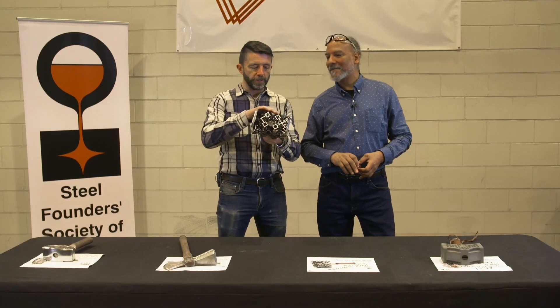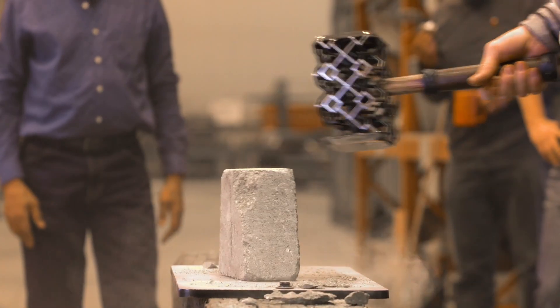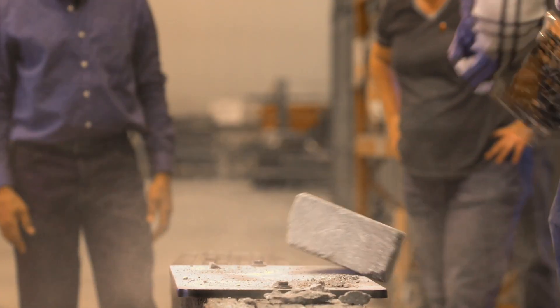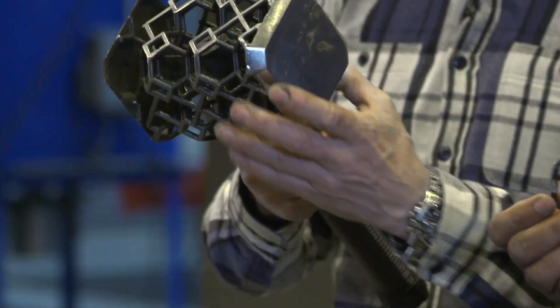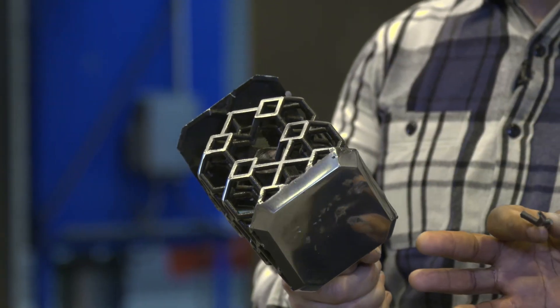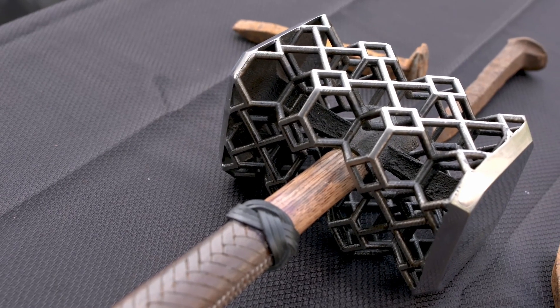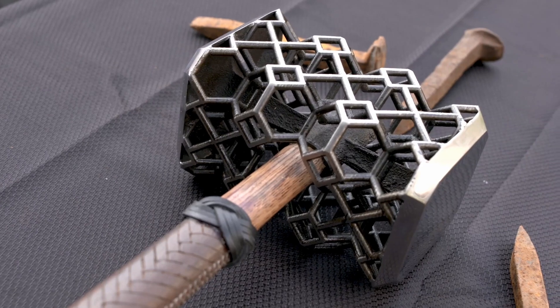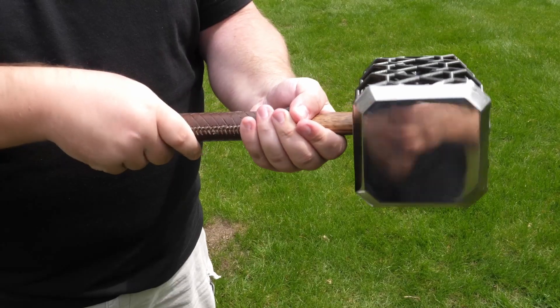The casting in here is really cool. It did, however, let go in a bunch of places up here. This is, I think, a combination of perhaps ductile iron and steel for the faces. Ductile is a pretty durable material, but in this case the dimensional lattice wasn't up to snuff — a beefier lattice would have been good. We gave this one the award for most intricate casting, and it just could have used a little more strengthening.